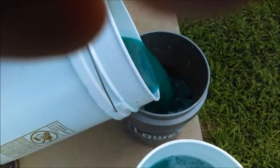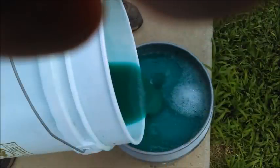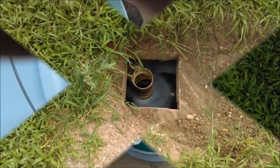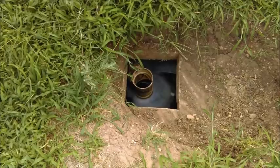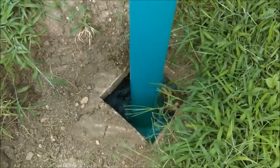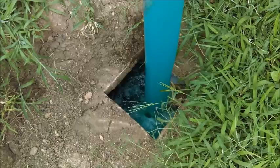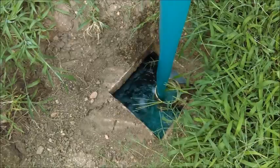Okay, so we've moved outside for the second phase of our shock today, and we're going to take the second pail of BIO-112, and we're going to cut it just like we did the first one with 5 gallons of warm water. We want to get the bacteria activated in it. And I would recommend, if you're doing this yourself, to get the tank open and let it set for a while before you go out and get over it and start putting in the mixtures.